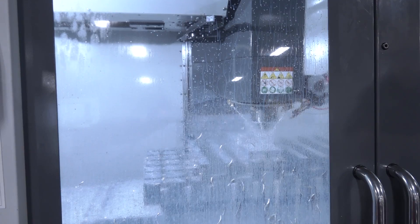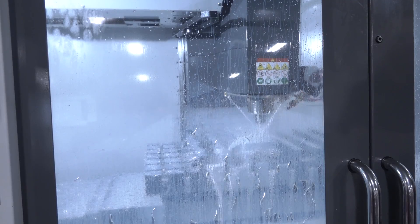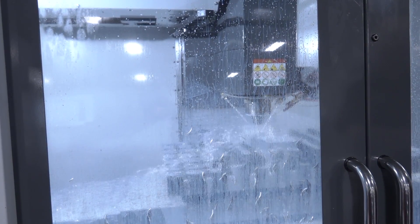It sounds amazing. Look at the motion control. It's a bummer we have to run flood coolant here, but there's no other way to run the tooling this fast. One of the things I want to work on is dry cutting in all materials, including aluminum. You can do it, but it will change your feeds and speeds, so more coming on that.